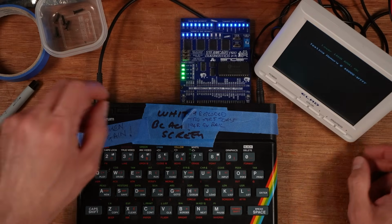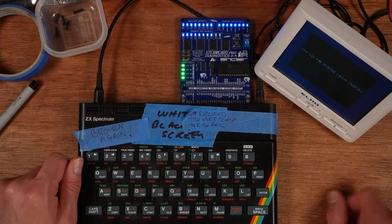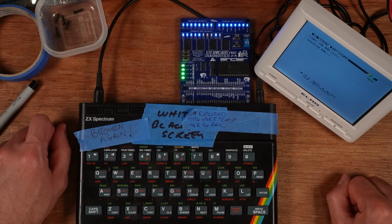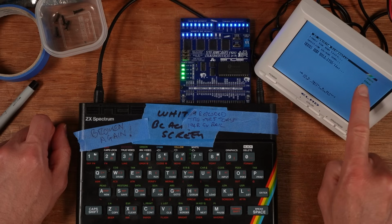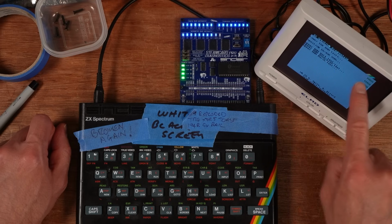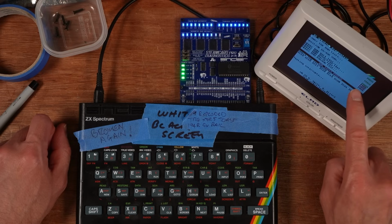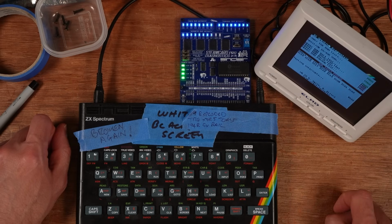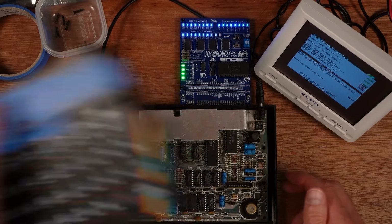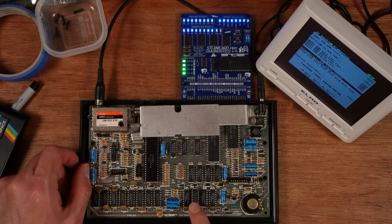There's a problem elsewhere. So turning off the Retroleum diagnostics, go back to the standard other diagnostics I use, the Brendan Orford diagnostics. I think it's Brendan Orford, isn't it? It will tell me in a second. Yes, Mr. D. Smith and Mr. B. Orford. And I've got 16K ROM pass and 16K RAM pass, but it's failing on the upper RAM, on the inversion test and the March test and a random test, and it's saying 1, 2, 3, 4, 5, 6, 7, 8 upper RAM chips have failed. So that's all of these chips apparently have failed, including the one that I've newly put in here.